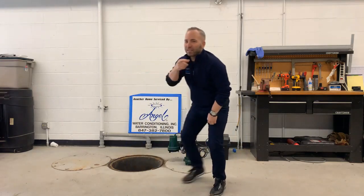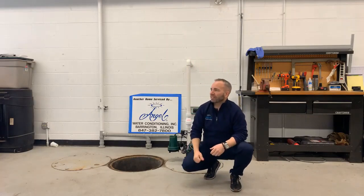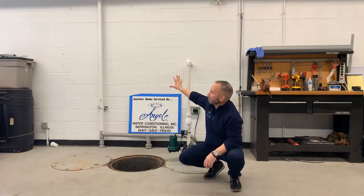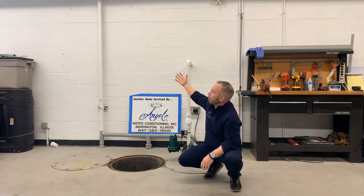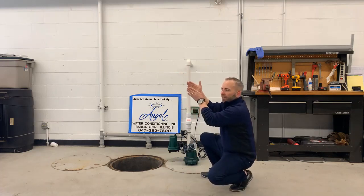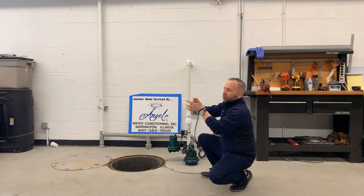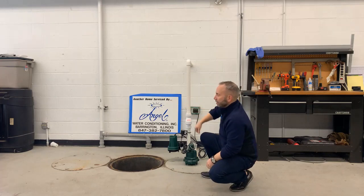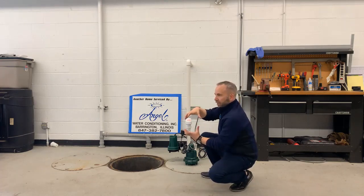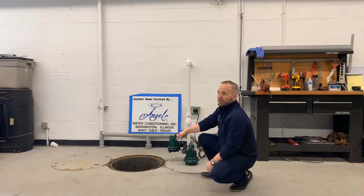As we were discussing, on the back side of the concrete there's gravel designed to allow water — rather than percolate into the concrete and crack it — to push down to what's called a drain tile that surrounds the perimeter of the basement. That drain tile is a corrugated tile and it ports all that water into the sump pump pit.